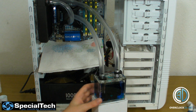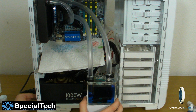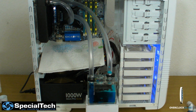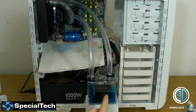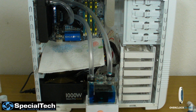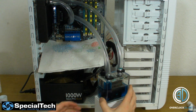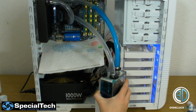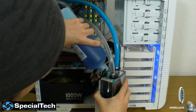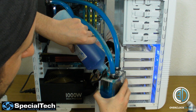I've filled the reservoir up. Basically what I'm going to do is turn the system on just quickly to show you what's going to happen — you're going to see it start pumping up the hose. Now straight away you can see it's starting to pump up into the hose. But what we need to do is, as it's pumping on an empty system, keep adding the fluid. You're going to hear a lot of gurgling noises because I'm trying to turn stuff on while keeping the camera on you so you can see roughly what's going on. The reason it sounds different is because of the water level going down below where the pump is.